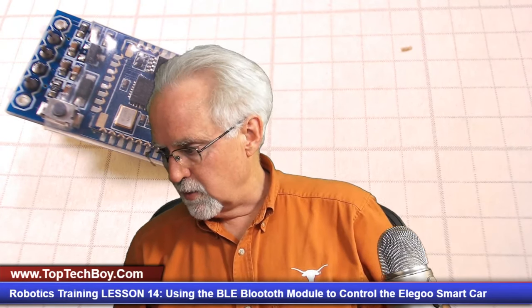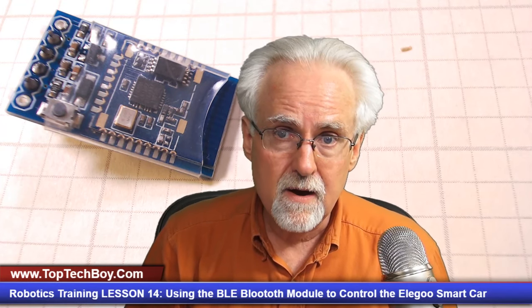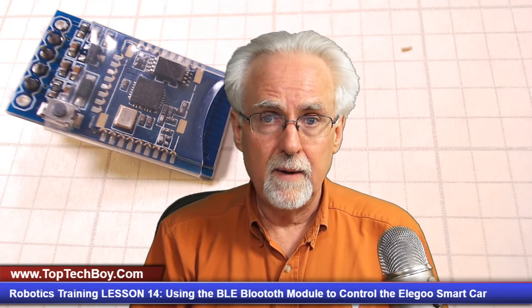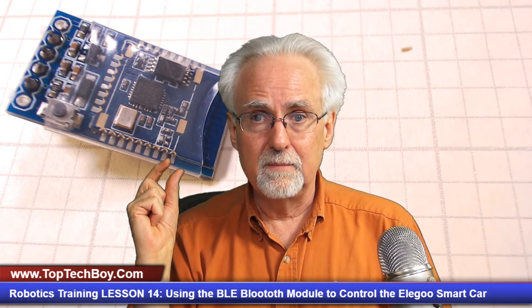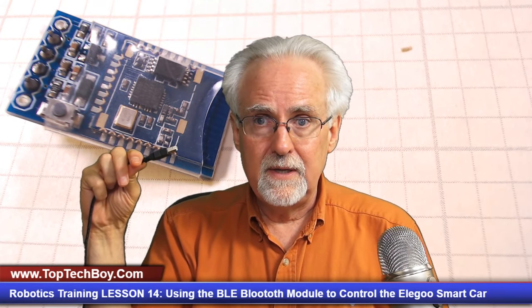What is the problem? The problem is the USB cable, right? The USB cable that we use to download the programs to the Arduino also uses UART. It also uses TX and RX. So once you plug the Bluetooth module into the smart car, you lock up the UART. You lock up the TX-RX, and you can't download a program, all right? So when you want to download the program, you have to take the Bluetooth module out. When you want to use Bluetooth, you have to unplug the USB cable, so it's one or the other.